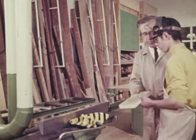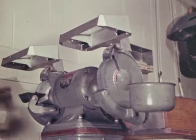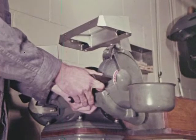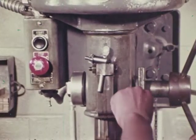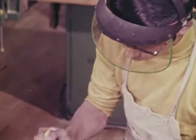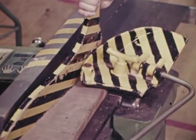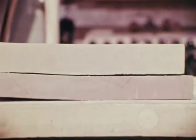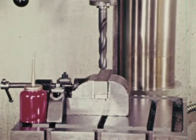The decision is yours. The switch should be off when you prepare the job. If you know how to plan and how to prepare, you will get the job done right and safely. Warped materials should be planed before working on them. They represent danger. So do knots. They might fly out. For each material, there are preferences and drawbacks.